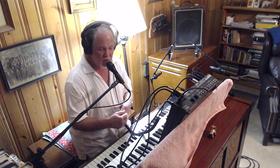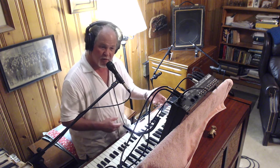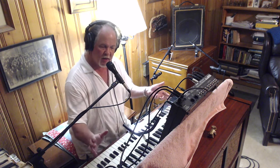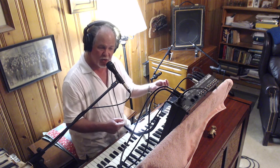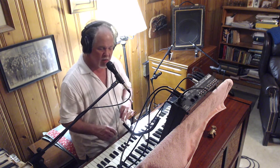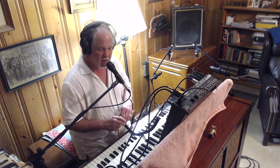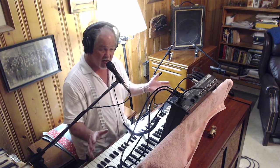Also, you're taking the speaker-level signal, so you want one from one of your main speakers, and one from your reverb amp speaker, and that's going to feed the OBL-2-2. And you have a button on the box that will adjust the amount of reverb. So I went through all that. Hooked it up his way, it didn't work. Hooked it up my way, it works just fine.